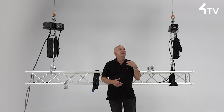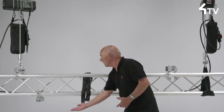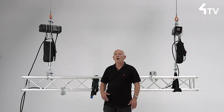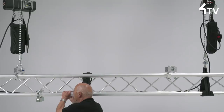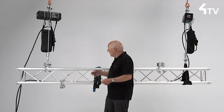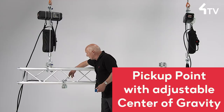One further potential advantage with a bracket is that it can be placed below the lower truss, like this one, to create a lifting point actually within the truss. This can be a great advantage in height if height is limited and we need to maximise trim heights. Obviously, on single spans of truss, there is a balance issue until the suspended load outweighs the empty truss above the pick up point. But with more complex box structures, this problem disappears completely. There are adjustable pick up point brackets — I can move the lifting eye closer to the heavier side at its centre of gravity.